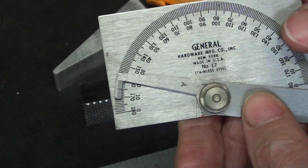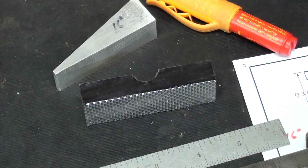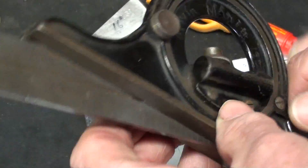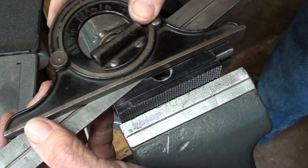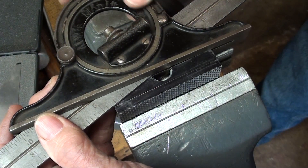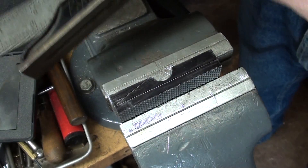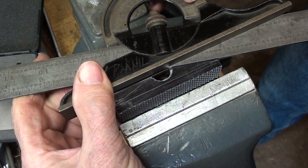You can use any kind of protractor you want. I consider this type to be only semi-accurate but it would certainly do the job. This is a regular Starrett one-sided protractor. I prefer for this application to use this double-sider, and I already have it set for 16 degrees. Put the work in the vise, just lay the protractor on, and line it up with that point. Slide it back and forth till you find the sweet spot and scribe it. Flip the protractor over and do the same thing on the other side.